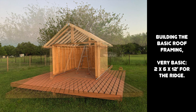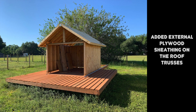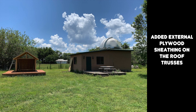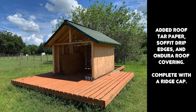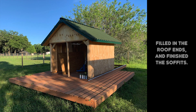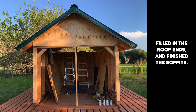I started the roof frame, which was a simple 3-4-5 pitch, using a single 12-foot 2x6 for the ridge. Roofing is always difficult for me, and I always use a ladder laid over the peak to do all the work. One of the hardest things about building construction is doing the soffits — you are always drilling and pounding nails upward, which is very strenuous.